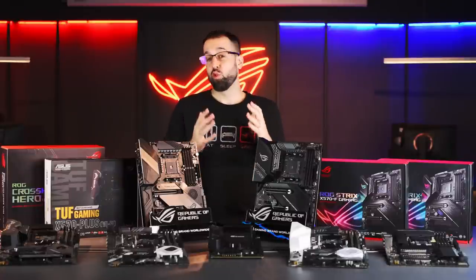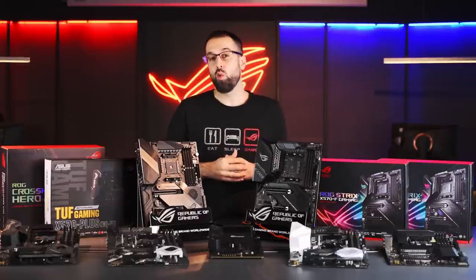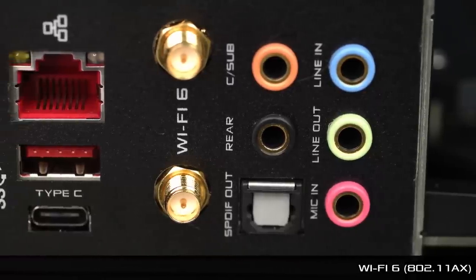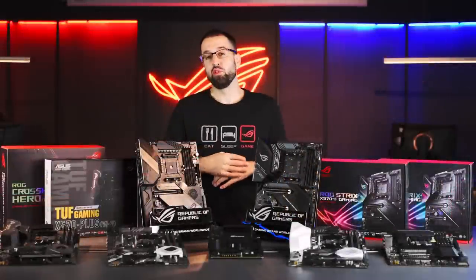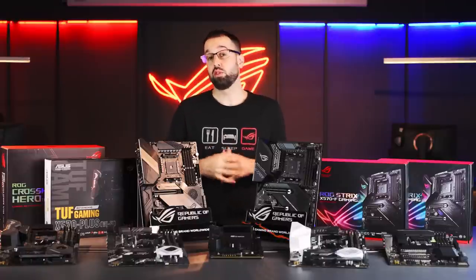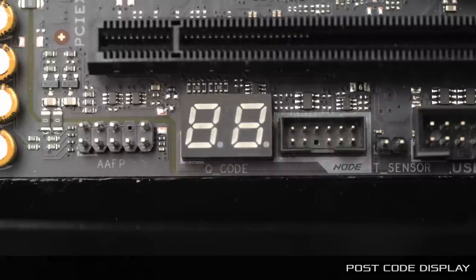If you're really looking for Wi-Fi in your gaming build, you'll want to step up to the X570-E. This Strix board gives you Wi-Fi 6 — the latest 802.11ax standard. ASUS already has amazing coverage of the AX standard with a bunch of router options ready to go. If you're looking for the latest-gen Wi-Fi, go with the E board and make sure you get a Wi-Fi 6 router to match. The X570-E also comes with a POST code display so you can quickly troubleshoot any issues when turning on the system.